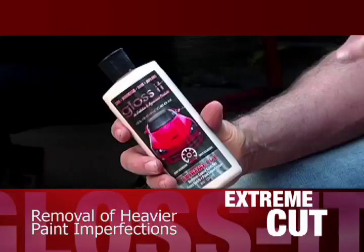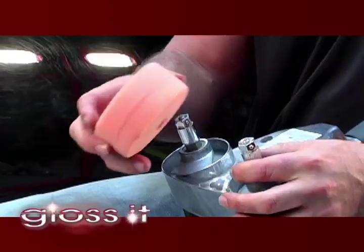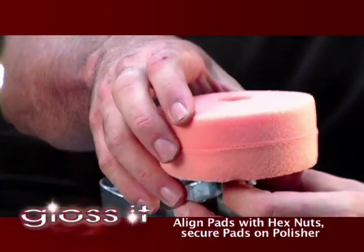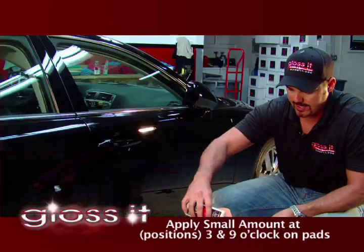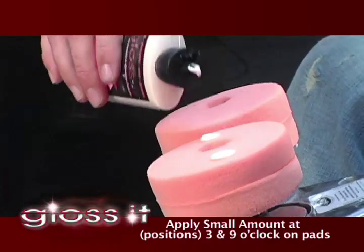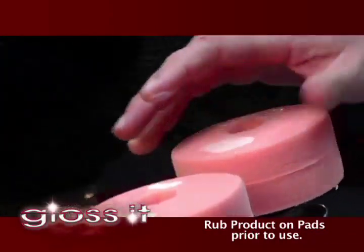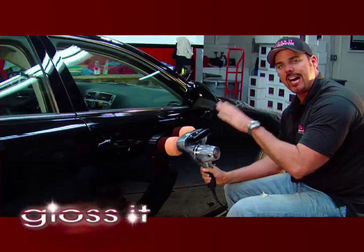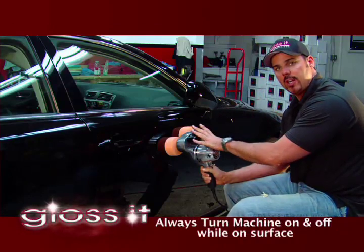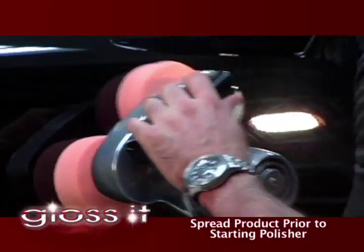The Extreme Cut is unique because it's a self-diminishing abrasive that's a water-based emulsion. I'm going to show you as a step here how we apply the 4-inch cyclo pads. You see the two quick-connect adapters here on the machine — what you want to do is line up the hex nut with each one of these and apply some pressure to make sure it's securely on. Now, there are two counterweights in this machine that keep it balanced and operating very smooth. You always want to turn the machine on when it's on the surface, and when you turn it off, make sure it's on the surface. This will ensure that you don't damage the weights in the machine.